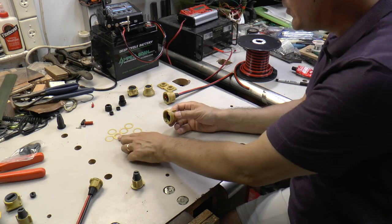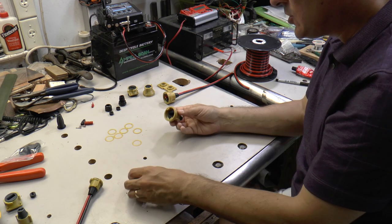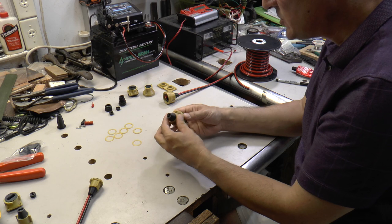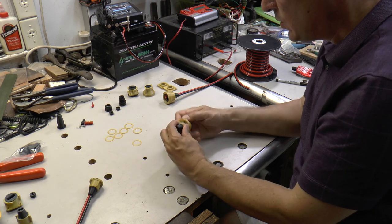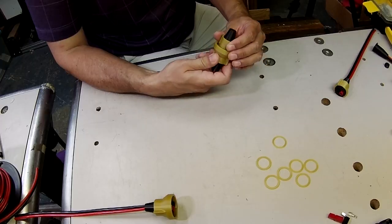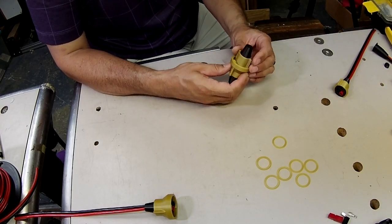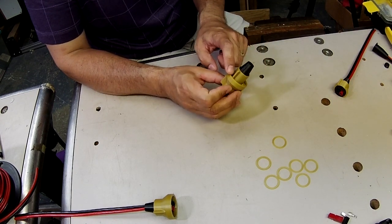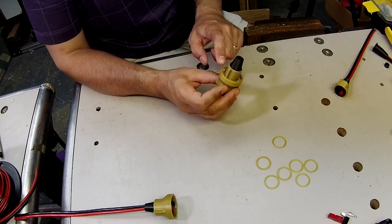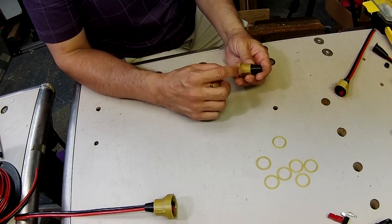And those friction washers can be made in varying thicknesses so that you can get just the right amount of compression on your connector joint when you put it together. You want to select the thickness of that washer so that when you put this together, when these first just barely start to touch, you're about a third of the way up the slope.